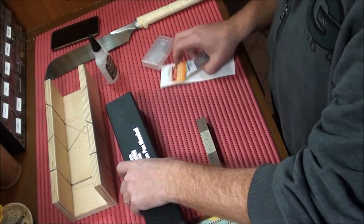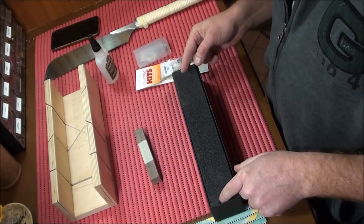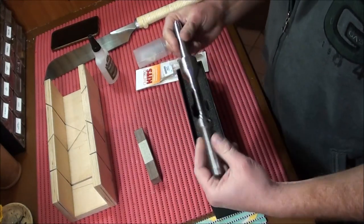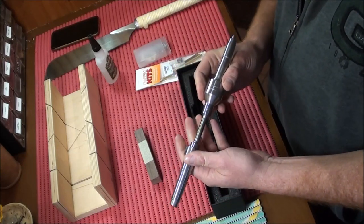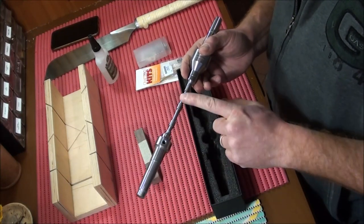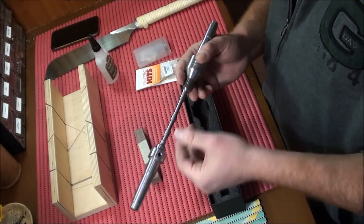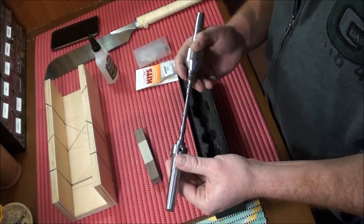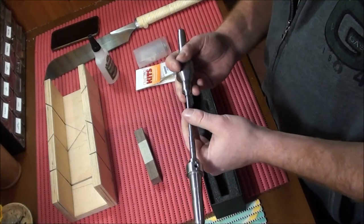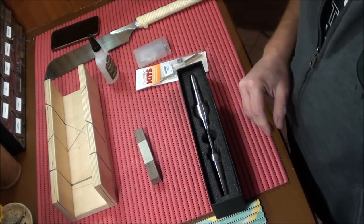And the most important thing is the pen mandrel. It's like a sort of jewel here. This is a specific type because it's a compression mandrel. This means that the force applied to the wood to keep it in position is not made on the mandrel, but on the bushing. So this will prevent the mandrel from bending. It's a nice pen mandrel, and we will use it later.